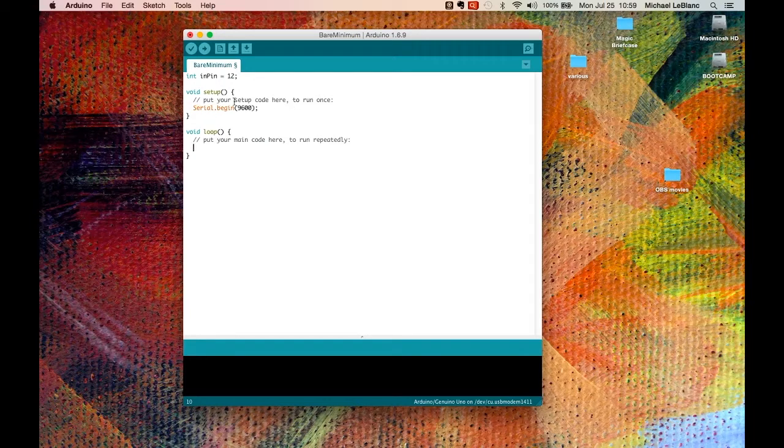The serial port is set up. Next, I need to tell the Arduino that pin 12 should be an input, not an output. Officially, I don't actually have to declare an input because the Atmel 328 chip sets things up as input by default, but it's good practice to declare inputs and outputs for all pins you're going to use. The command is pinMode — small p, big M — and you can see that it turns brown when spelled correctly. If you don't use a capital M, it's not recognized.